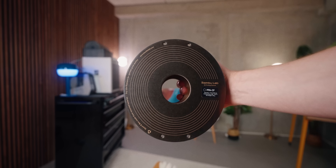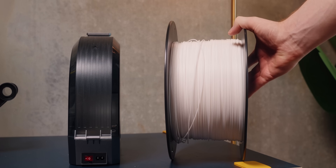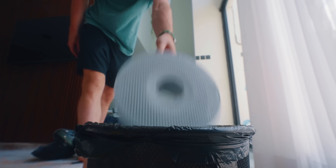If any of your filaments get too wet and you can't print them without huge quality issues anymore, a filament dryer is really what you want. All filaments need different settings but usually you can just throw them in the filament dryer overnight and dry out most of the moisture, making them printable again — so you won't have to throw out the whole roll of filament.